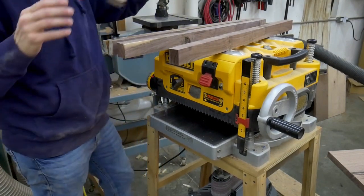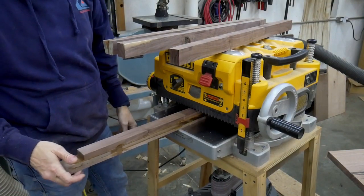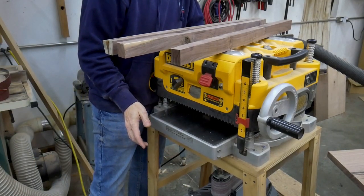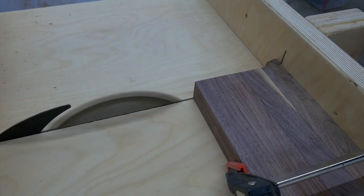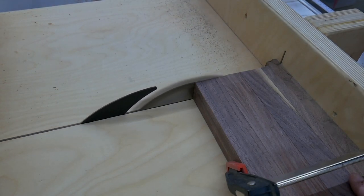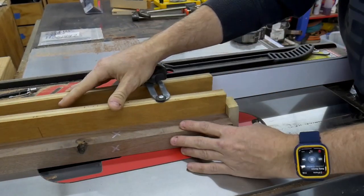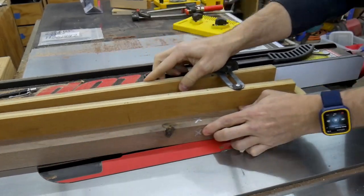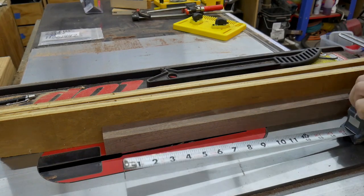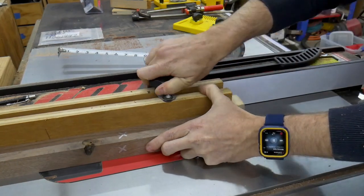This is a little thinner than the 1.5 inches that I designed, but I will be able to adjust the design to accommodate. After planing, I trim all the legs to their final length and move on to the tapering process. Setting up the taper jig is a bit fiddly, but with some patience and a little luck I am able to get it set in the correct position. The X's on the leg denote the off-cut side of the taper so I can cut around many of the knots and other flaws in the wood.